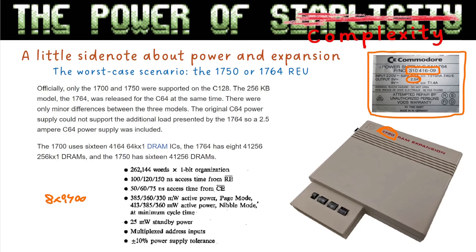That was rather long and windy, but I had to go into some detail to really explain what's going on inside the C64. We have already uncovered some things that are widely under-communicated: the short boards need much less power, they get less warm than an older breadbin. One thing that's somewhat controversial is that you really don't need AC voltage at all — you need to feed something to those terminals, but it could be DC voltage.